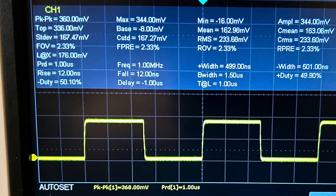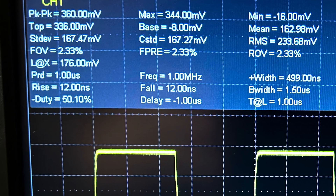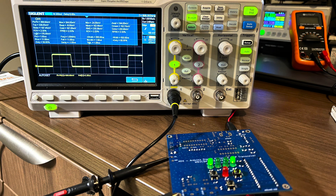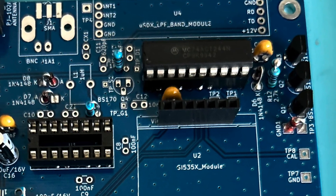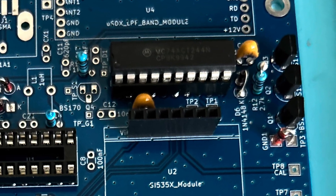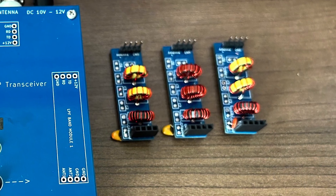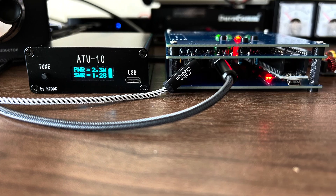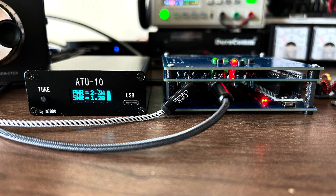It's not long before we can start to undertake the first test on the VFO — we're looking for a 1 megahertz frequency signal coming out of the VFO. Don't worry if you don't have test equipment; we'll have people there who are able to use it and can test and work with you as you progressively make the build. Add a few discrete components, move on to the power amplifier section, install the power transistors, and then finish off any low-pass filters you need to complete your kit.